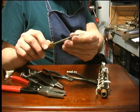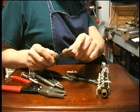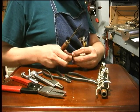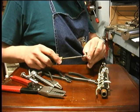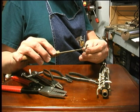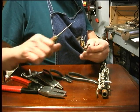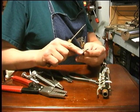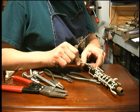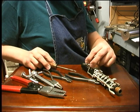These are hinge tube shortening tools. It's got 4 cutting edges on it and a pilot that fits in the hinge tubing. This one's a little too big, but that would fit in there, and you can trim down, turn it around against the edge of the end of the hinge tubing and shorten it up again until it fits just right between the posts. And that's key swedging.